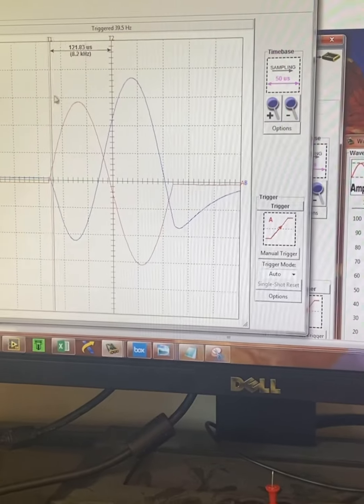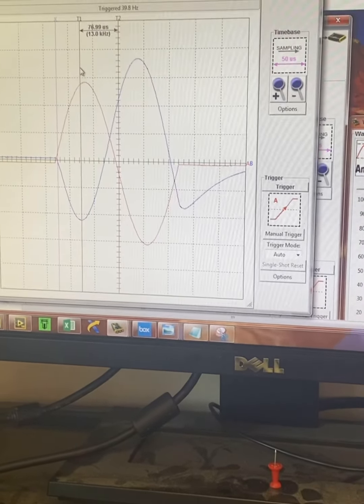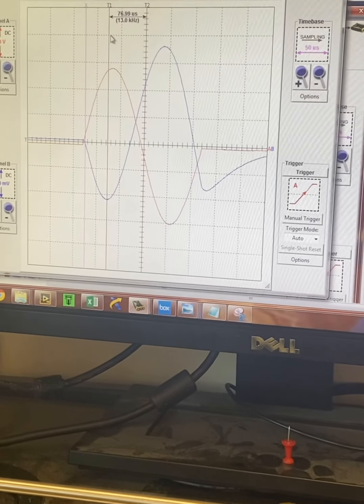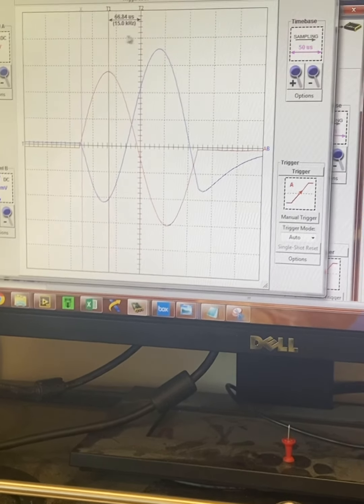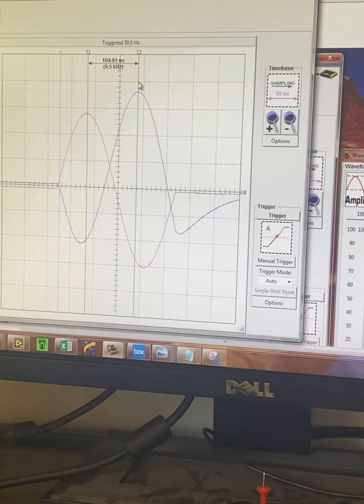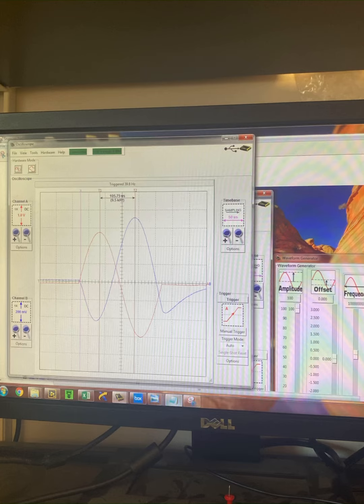This is a reading of a shear wave velocity test, and here we are measuring the shear wave velocity using the peak-to-peak method. As you can see, the red line, or the red wave, is the wave that is being pushed through the sample, and the blue line is the receiving end. So we're measuring how long it takes to get from one end to the other end of the bender element. You can measure it by taking a screenshot of the entire screen and also exporting your data through the Tools menu. There are many examples of this on the desktop under the Instructions folder.